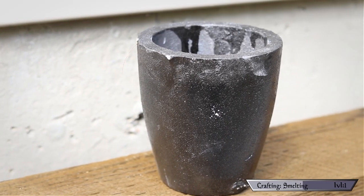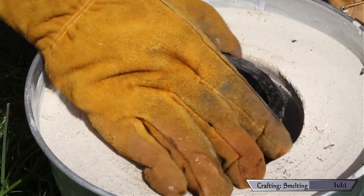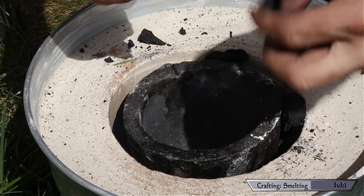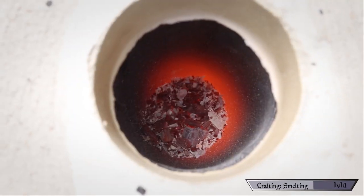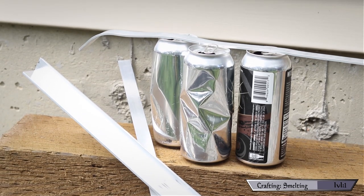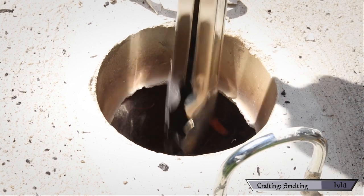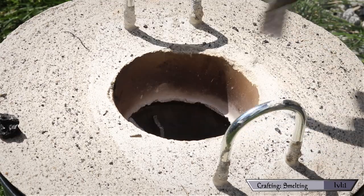You can't just throw metal inside the furnace — it'll melt at the bottom and you'll never reclaim it from the ashes. You need a crucible: a container used to melt metals and other materials. In Grant's original video he used an empty fire extinguisher cut in half. In his follow-up he recommended a clay graphite crucible. I picked one up for $18 on Amazon, which is cheap for something specifically made for this purpose that will last way longer. I added the crucible to the embers, packed extra charcoal around the sides for even heat, and in no time my little crucible started to glow an angry red. I fed it aluminum scraps and cans, and this little thing made super short work of everything I threw at it.